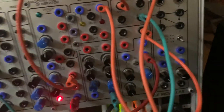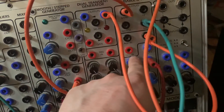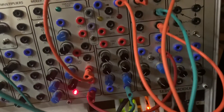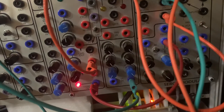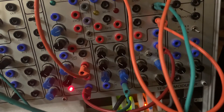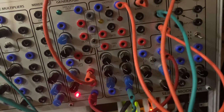I'm not exactly sure why that happens. I can guess the trigger input — the little op-amp circuit in there almost acts like a flip-flop. But it's temperamental and it seems to be frequency-dependent. Some frequencies it works well, others it stops entirely.